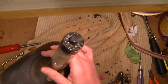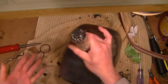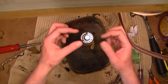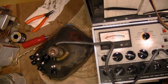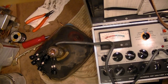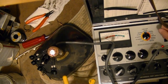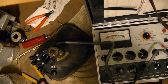National Video Corporation - date code 634, like the 34th week of 1956 would be my guess since these sets were sold in '57. Now to clean off this neck, then I'm going to reheat these pins and pull the base off to make sure all these wires are present and accounted for - it could also be a break inside this cap. Alright, in manual restore 2 mode it really cooks the filament, then switch to remove G1 short, hold down the red button, whack the side of the neck, and look for a spark.